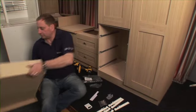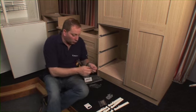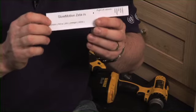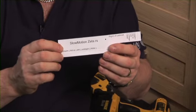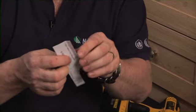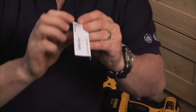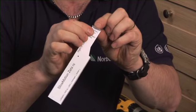Move the drawers like this and then fold the paper template. This template is used for fixing the soft close mechanism to the side of your unit. You bend the cardboard like this at a pre-marked point, and then you bend the front piece the opposite way so it acts as a stop.